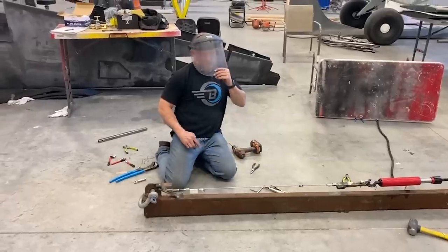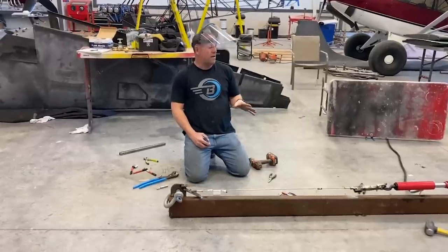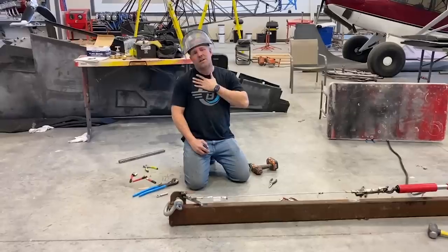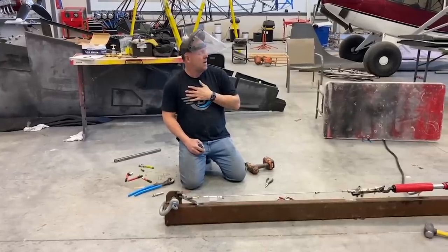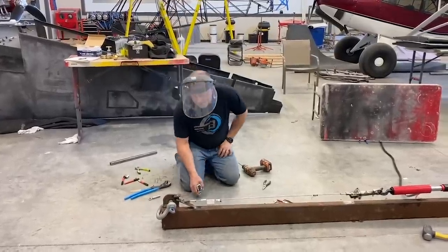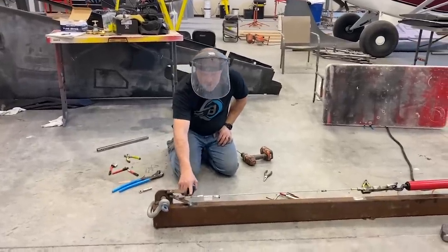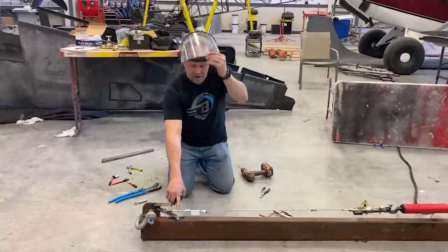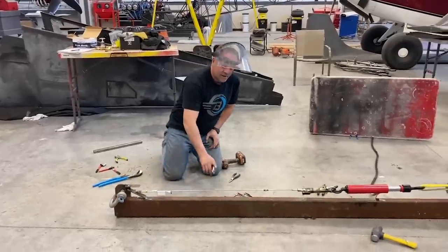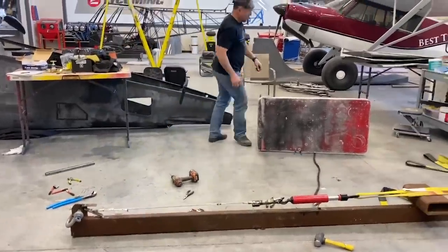All right, guys, so at this point, I'm seeing the first sign of a failed part. This is now stretched over an eighth of an inch. That was kind of my limit. I'm gonna let the pressure off and see if it comes back. Bolt point looks good. The head looks good. You can't tell on threads unless they let go. So I'm gonna say threads are good, bolt point's good, the head looks good. The bar is stretched. So 600 pounds, we got stretch.